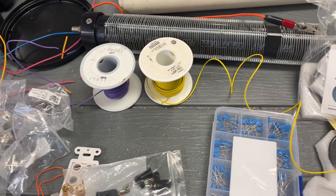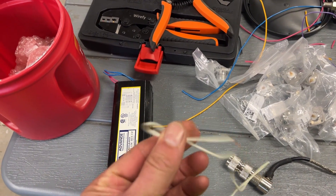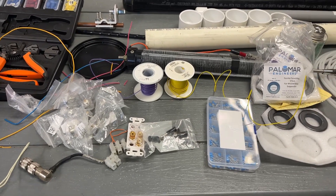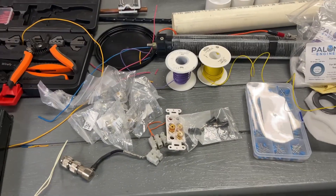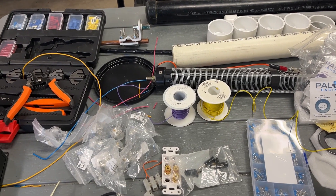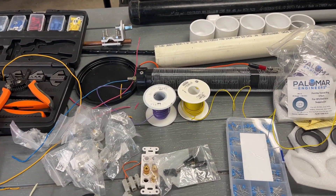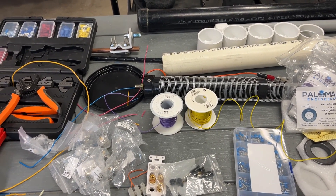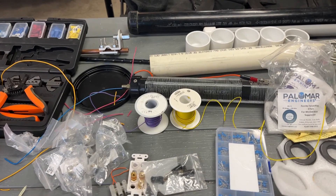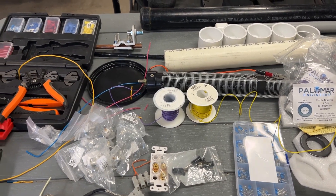For wire, I recycled solid copper wire off of a fluorescent light ballast — it had the perfect gauge. I've also got some spools of wire. The idea without crunching a bunch of numbers: grab some random wire — 73 feet, 80 feet, whatever — throw it up into a tree, try different heights, different counterpoises, and clip your antenna onto different outlets of the balun or unun. You can make it a dipole, an end-fed, whatever you want. Put it on a piece of cardboard and start writing down all the different numbers and SWR readings that work for you.